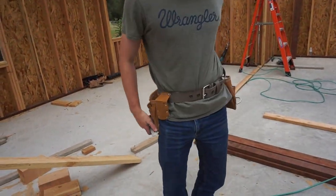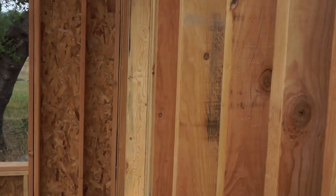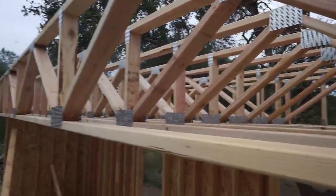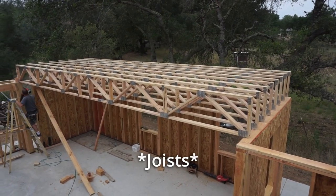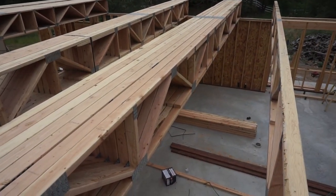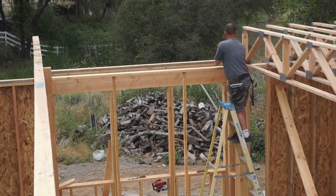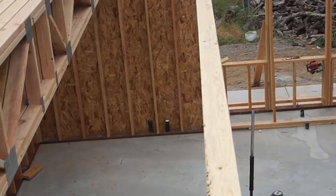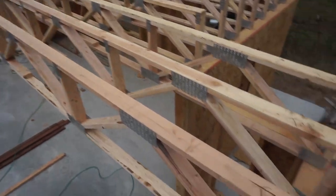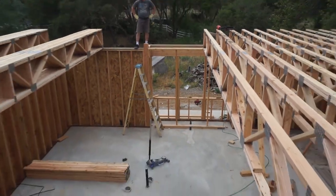You can see all of these are nailed in place. Good job, Dad. There's a better view of the floor joists that my dad already did. Here's some more that we're going to do — this group of them are going in that area where my dad is. Right now he's supporting that 2x6 going across with a couple pieces of lumber so that we can run these trusses on top. And there's what it looks like with a few of these guys done. The long ones go over that pop-out window section. We're going to keep working on these — there's a lot more floor joists to do.